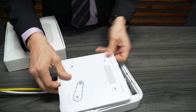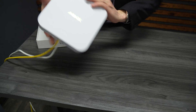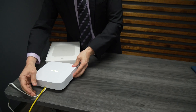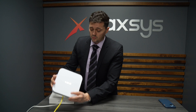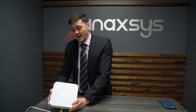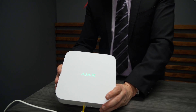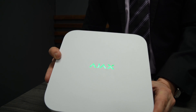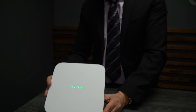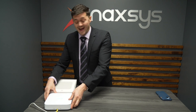Now I'm going to slip the back plate on. Just like the hub, the Ajax NVR is automatically going to have lights pop up. Right now it's got a yellow light. What's going to happen is it will power itself up, read its hard drive, learn the hard drive in, and then look for the internet connection. Once it turns green, you know that it is connected to the internet and specifically to the Ajax cloud, which means we can now learn it into the app.